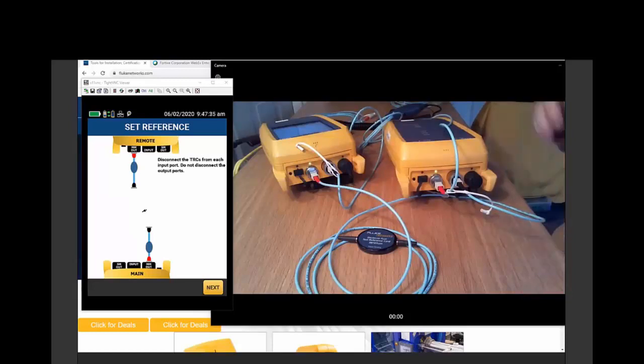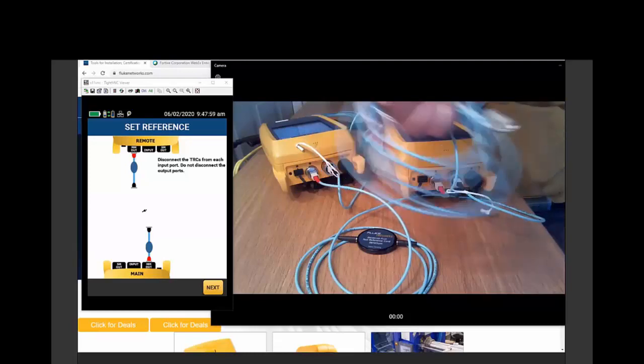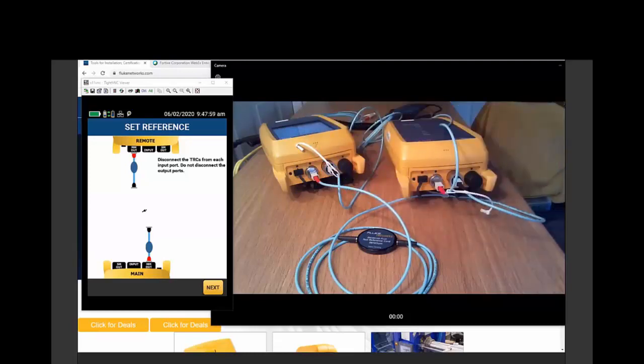So, Jim, this is where the color coding of those TRCs comes in very handy. I can never remember which end, but I can always recognize the color. Good point. Good point. Okay, now, I got to give credit to the Corning FAEs who pointed this out to me. Before you disconnect the fiber, what are you going to do with it? Don't hold the bare fiber in your hand and wave it around and say, hey, where's the connector? Where am I going with this?